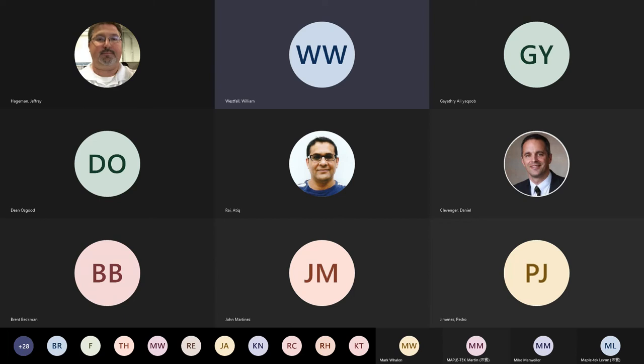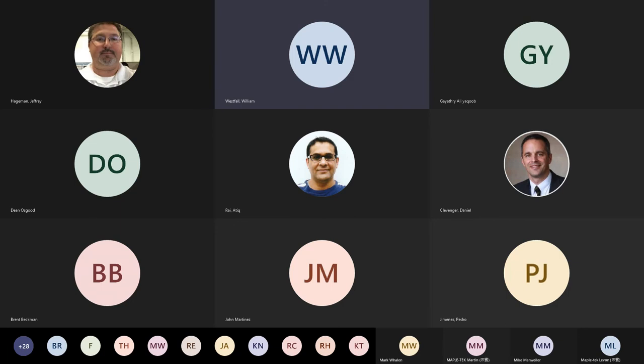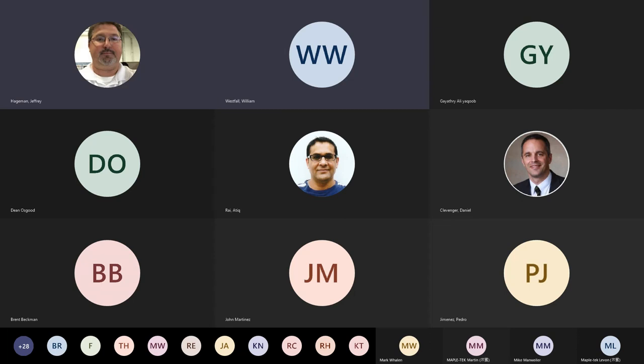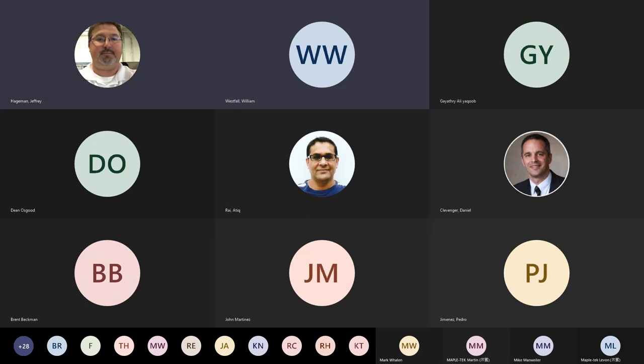This is something that is affected by the date and time. So if all of a sudden you go to print off a shift report and nothing prints, and you move the red knob and you get a diagnostic ticket, check your date and time. Chances are that your date and time has been reset. What's happening is the LCR, when it started the shift, had a good date and time of, let's say, a day ago or this morning. But during that shift, the date and time may have somehow been reset to a previous date and time. The register gets confused because it can't calculate a shift when the end of the shift is before the beginning of the shift. So it doesn't know what to do with it, and in that case, it prints you out a diagnostic ticket. So if you see that it won't print a shift report but you do get a diagnostic ticket, check your date. The chances of the date being reset to some previous value are high.